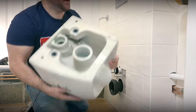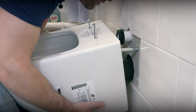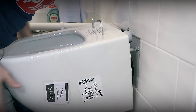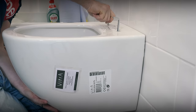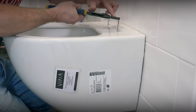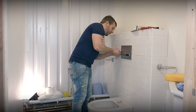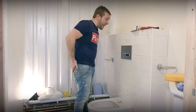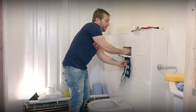Let's get this hung up and have a quick look at how we go. I've got to say I'm so impressed with this system — it's ridiculous how excited you get by this sort of thing. Get the top hole started, make sure the cone goes on at the back — that's in. Then push the whole thing back together, use our weight to hold it up in position, and tighten these up. Nip these up as hard as you think you want to — remember you're only ever going onto porcelain here, so it's all about judging it. I'd say that's never going anywhere. I've put everything together and I'm happy that it's all there. I like to get everything in and done, then fill up properly with water — that's just my way of doing things. I can now turn on my water supply and get this filled up, and I'll wait a few minutes before putting everything back together to make sure it shuts off at the right height.